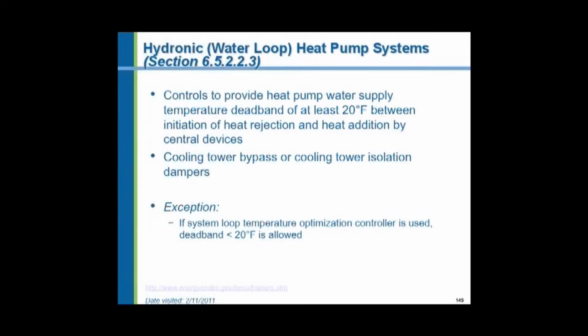Now, there's a system called a heat pump system in a water loop. And what this means is that inside of a building, there are pipes circulating water. The interior spaces in a building may require cooling all the time. There may be enough heat-producing activities going on where you're going to have to air condition them night and day, summer and winter. But yet the outside surfaces of the building and the outside spaces will need heat in the wintertime and, of course, cooling in the summer.